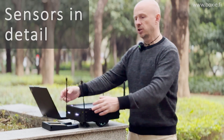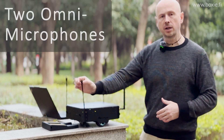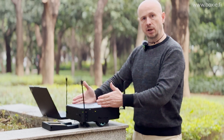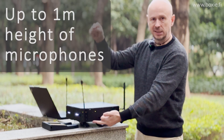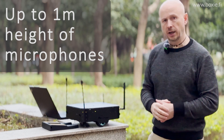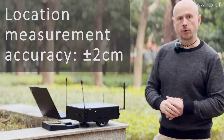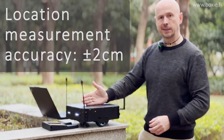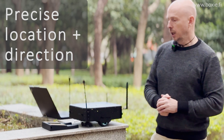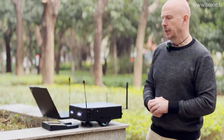The main sensor is the indoor positioning system, which uses our ultrasound plus radio-based system. It has two omni-microphones — only the top 25 centimeters are exposed. If you want to install a basket, like a one-meter basket, not a problem, because there is a one-meter cable inside. You can unscrew four screws and put the sensor on top, so your basket won't produce non-line-of-sight interference. The robot measures the location of each omni-microphone with two centimeters accuracy, and by knowing the location of two microphones, it knows not only its precise location but also its direction.